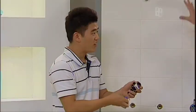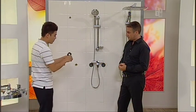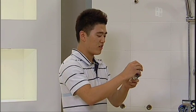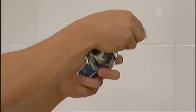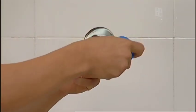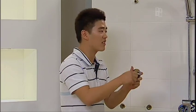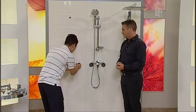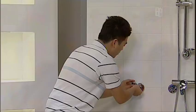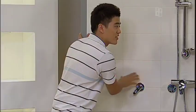So we've removed all the hardware. What I'm doing right now is just putting plumbing tape around our patent fittings — maybe about two or three rotations on this one. You don't have to put too much. You can buy that in any plumbing store — Bunnings should sell that — it should only cost about two or three dollars. And then once you do that, just count how many times you rotate it around. You've got to level both sides together. I did seven on this side. It really does depend, but you can tell just by slipping your finger behind them.